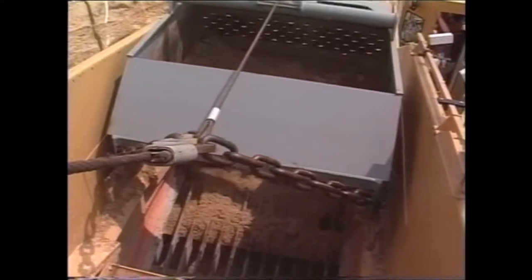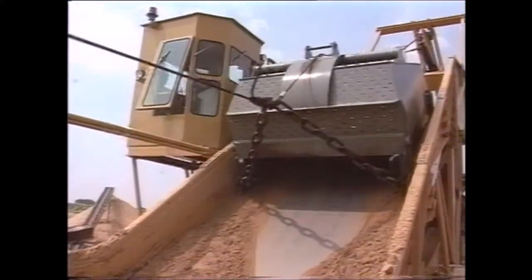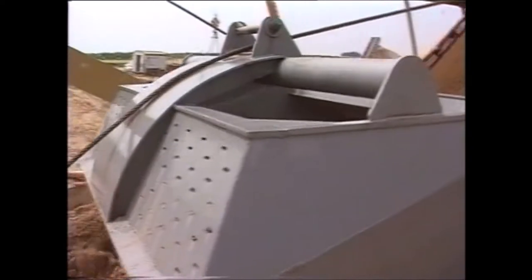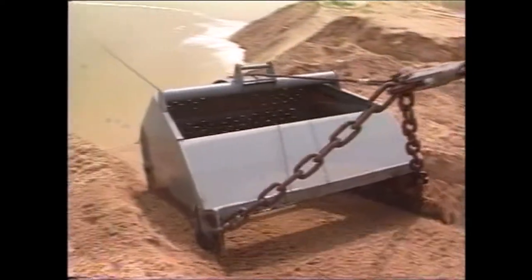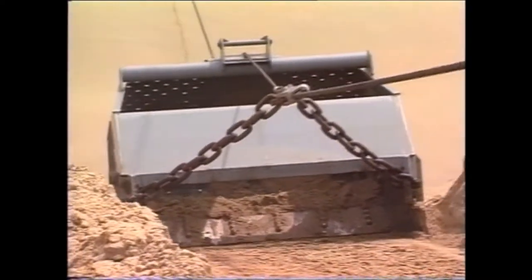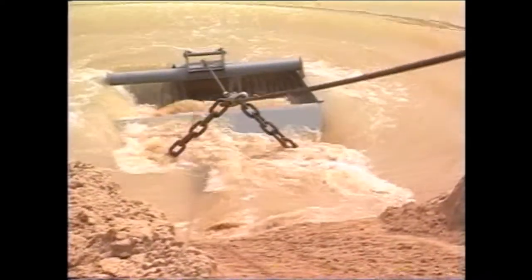The rear end of the bucket has a movable flap, which is also provided with a blade of wear-resistant steel. This movable flap ensures that the bucket does not take dredged material back into the water. Above the scraper bucket runs a lifting rope connecting the outhaul and in-haul chains and ensuring that the respective passive rope does not drag in the dirt.